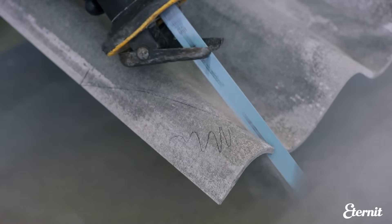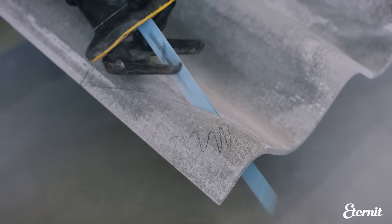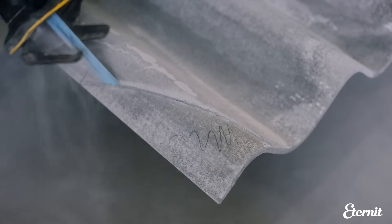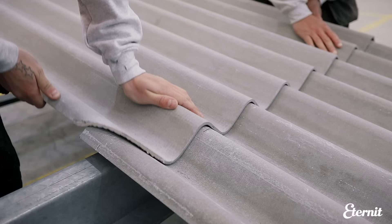All mitres should be cut at ground level using a hand saw or reciprocating power saw with blades at a 3-3.5mm tooth pitch. The dust caused by cutting should be classed as nuisance and non-hazardous industrial waste, and appropriate PPE should be used.